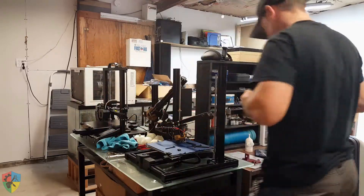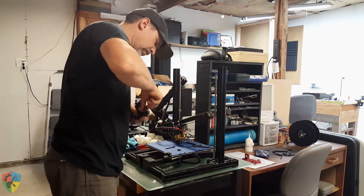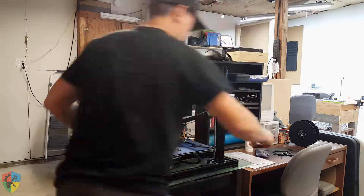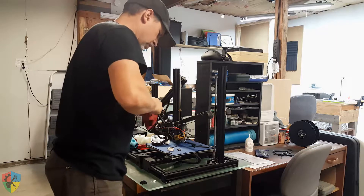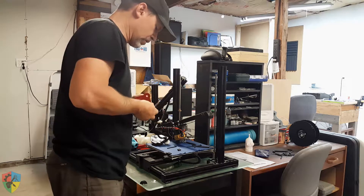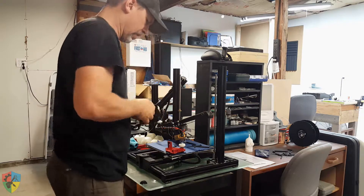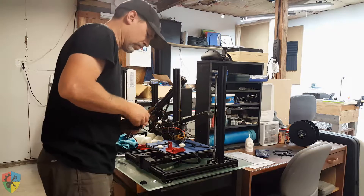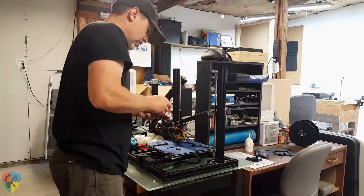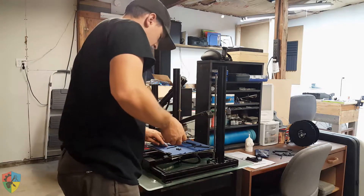I think that's because it's the only place that has any real tension to it. The way it attaches to the gantry — you want it firm, but it doesn't have to be very tight. The part that needs to be tight is that inward tension along those rails so that everything stays in place as the 3D printer does its thing. I'm taking the little nylon wheels off the old brackets and putting them onto the new ones. I was very surprised — the reason I was apprehensive about doing the 3D printed version of these brackets is you don't get 100% accuracy.